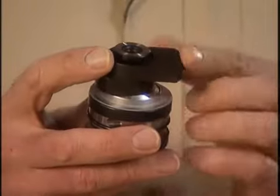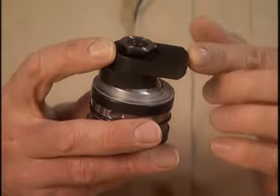But perhaps the most important design attribute of this motor is the counterbalance weight. This counterbalance is precisely machined for each of the orbits available from Sioux. The 3/32 orbit has a specific counterbalance. So does the 3/16 and also the 3/8. That eliminates the vast majority of the vibration that is generated in this motor package and vastly reduces the vibration transmitted to the operator.